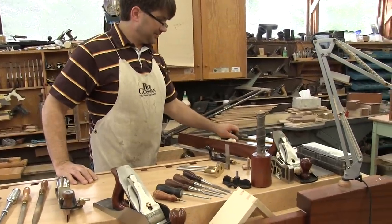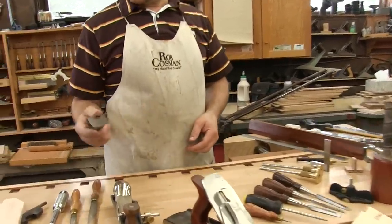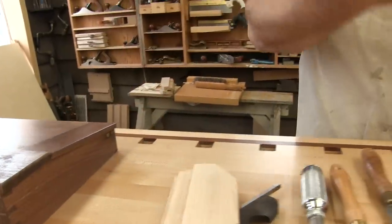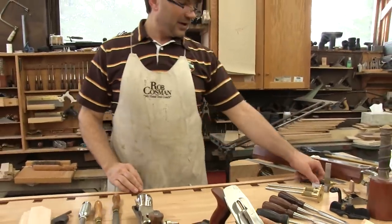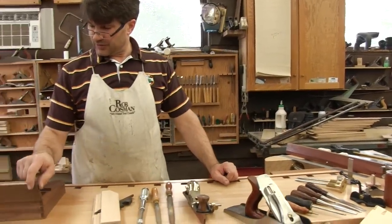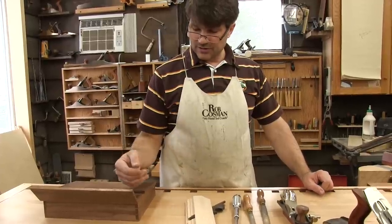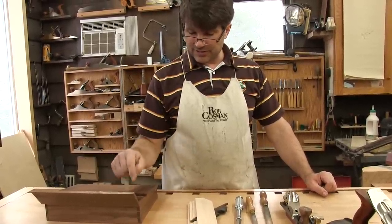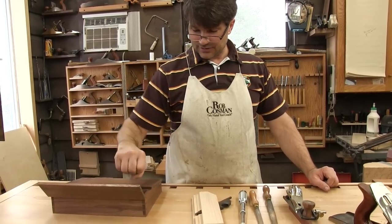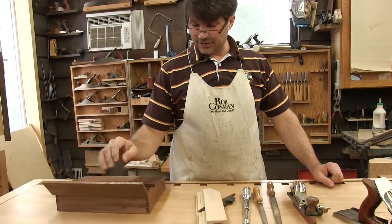You're going to need a small crosscut saw. A couple of steel rules come in handy. I have this little squirrel-tail plane — I find it really convenient for cutting small radiuses or chamfers on small pieces. I've got an awl. When you're drilling pilot holes for the screws and hinges, you want them to be precise. I always set my hole just a little bit on the inside of center so that, as that screw tightens down and that countersunk head pulls on the hinge, it pulls it in tight to the back wall.